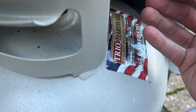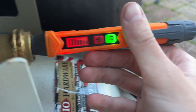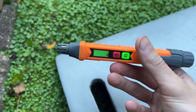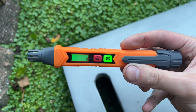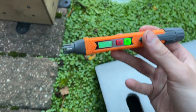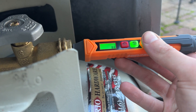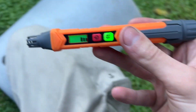I put it right into the gas source, then pulled it away and counted the seconds until it cleared — about four seconds on camera to clear. That means it also detects within four seconds. I put it back and checked the timer again — four seconds. That's accurate enough.